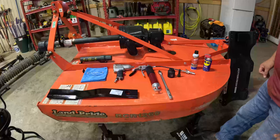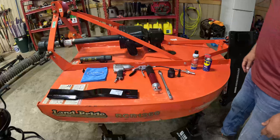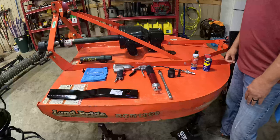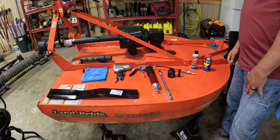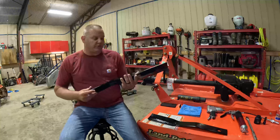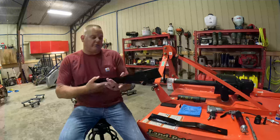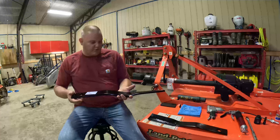I'm not just going to change one blade today — I'm going to change both blades — but I'm also going to do some general maintenance to clean it up, make sure everything is operating properly, greased up, and ready to continue the rest of the season. Now, there is a correct way and an incorrect way to put these blades on directionally, so pay attention to how it comes off on the bottom, because if you invert it it's going to wind up hitting the top of your deck.